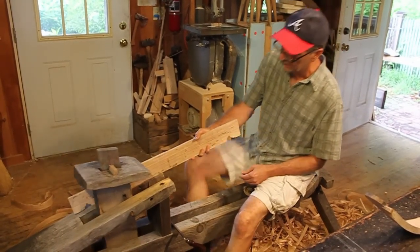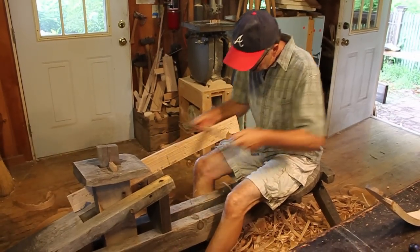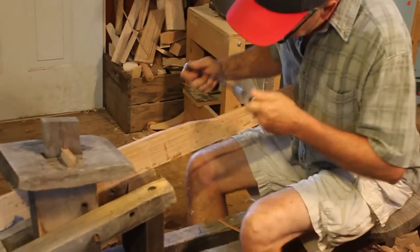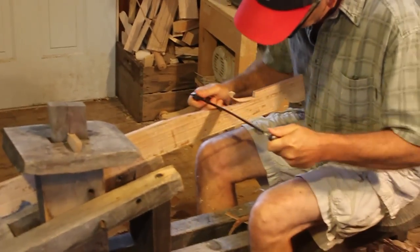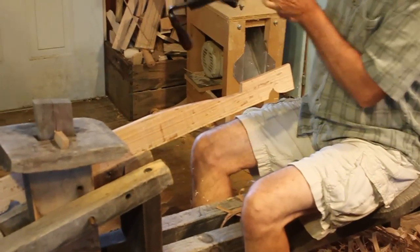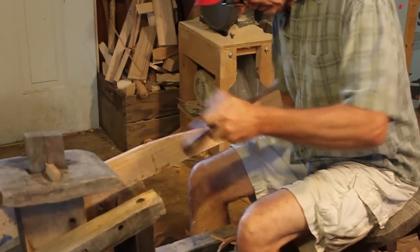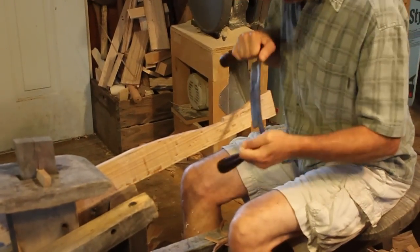All right, so let me repeat once again. You probably want to do this on a bandsaw, but if you don't have one, you've got to push it. You don't have quite so much power pushing this thing. You see the way I'm angling it and taking off that corner, take off that corner, then take off the middle. And I'm also slicing it and I have it skewed.